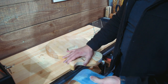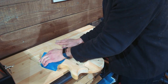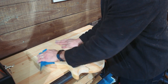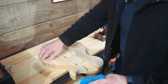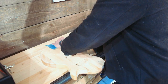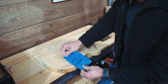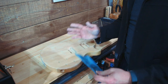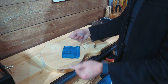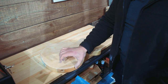The only place where sanding with your bare hands is the best option is over these little curves. I just bend a couple fingers over and give it a few swipes — these small curves generally don't need as much sanding as everything else. Some people will be tempted to use a long piece of paper; that's good for shaping necks but it's not great for these little tight corners, as you can actually flatten them out doing that.